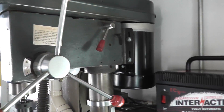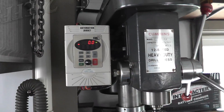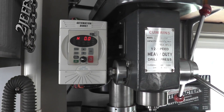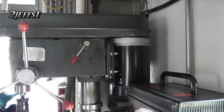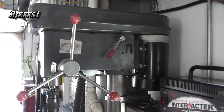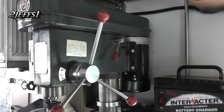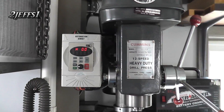Let's start out with some basics. You cannot make a single phase motor variable speed — the ones with the capacitor start. You have to have a three phase motor. You'll also want an 1800 RPM motor because your frequency drive can run up to 400 hertz, where you can spin that motor very fast, and you'll have good low-end torque with the 1800 RPM motor.